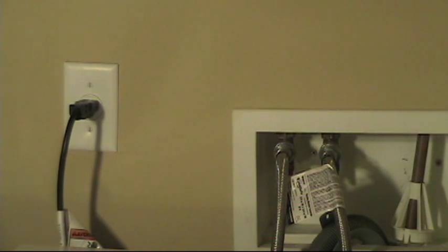The things that can go wrong with something like this would really only be a broken, damaged, or worn receptacle, or should something happen to the cable between here and the panel, or connections in the main panel.